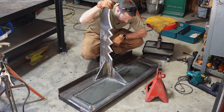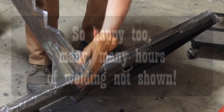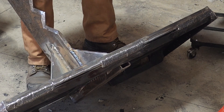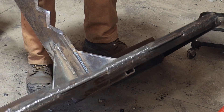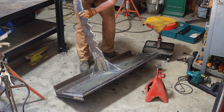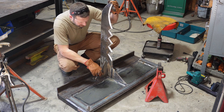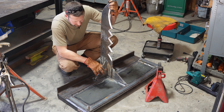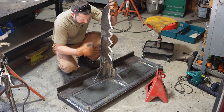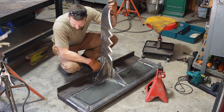I'm done with the welding. I've got the top supports here, the quick attach supports, triple welded to give it a little extra strength. I've got MIG weld under everything to fill in all the deep roots that a stick can't get into. And then I put 7018 on top of that, and then I put 6013 on top of that to kind of smooth it out a little. It feels stupid solid.